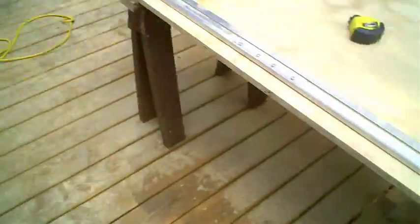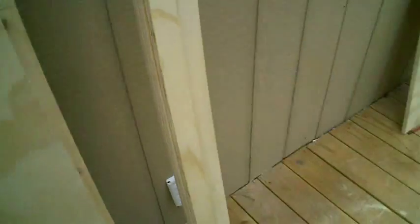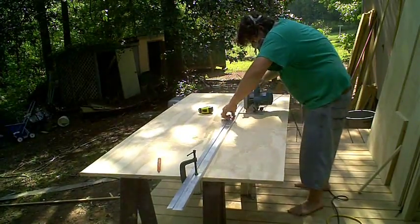I just made a mistake — it's going to cost me a little bit of plywood. I put the guide to 13 and one eighth when really I should have put it to 13 and five eighths, so this piece is a half inch off. This piece will be used for something else. I got the back cut, the sides, the three shelves including the bottom and the top. Actually, this is what I'm going to cut the doors out of. I got the wood for the face cut — six pieces of it, more than enough. So tomorrow I'll build the carcass of the cabinet, face it out, and then cut my doors.